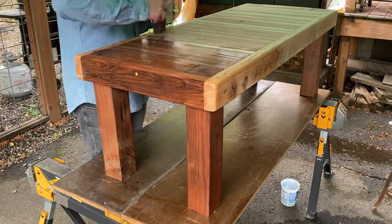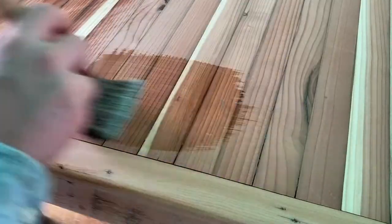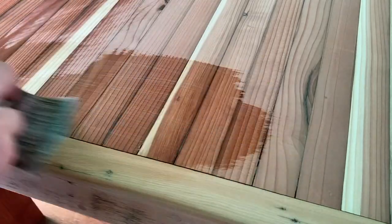To get a smoother surface I would put one coat on and then sand it with a really high grit paper — maybe like 300 or 320 — and then put another coat on after that.